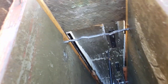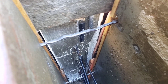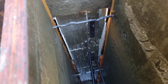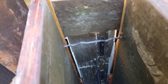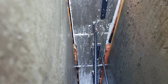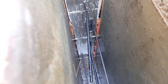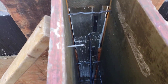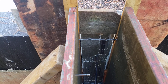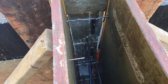Also notice here, we've basically plowed out the ICF — the EPS of the ICF, the expanded polystyrene, which is the rigid foam of the insulated concrete block — and we've basically exposed the concrete core. If I drop down in here, you'll see that's the whole concrete core all the way down to the footing. And then we have these pieces of rebar that now tie the house foundation wall to the garage foundation wall. That's an eight inch width, fully plowed out to the full eight inches, and we get a nice concrete on concrete.